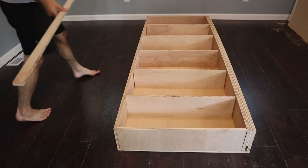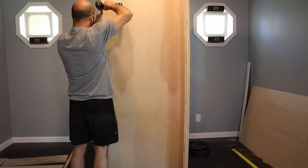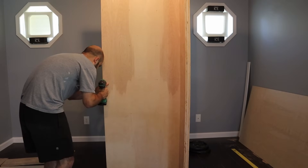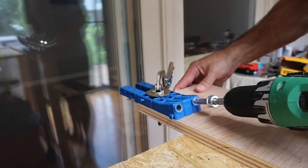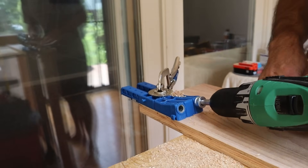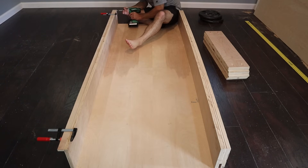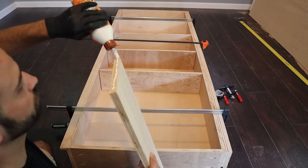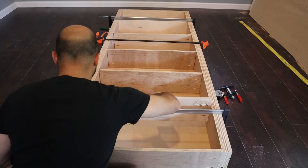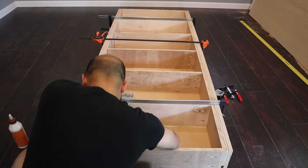I also cut out a small piece of wood to attach to the left side of the frame to make it appear that both sides are the same thickness. After attaching the right side to the backing, I pre-drilled some holes to make assembly a little bit easier. I also used a jig to put pocket holes in both ends of all the shelves. Next I screwed in the little faux piece of wood, then I laid all the shelves in place and applied glue to each one in turn before installing them. The shelves got held down with the pocket hole screws and the clamps helped to keep everything square until the glue dried.